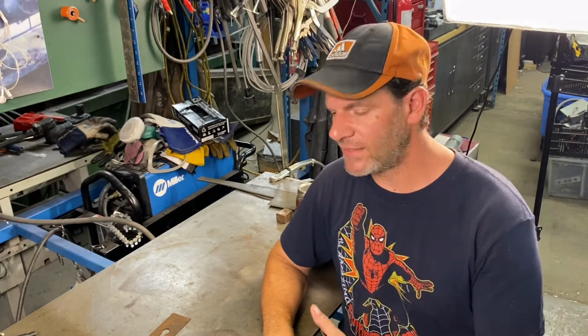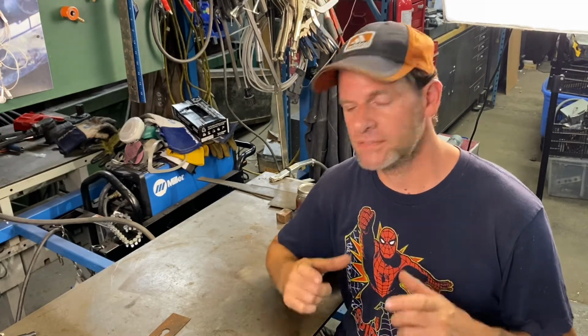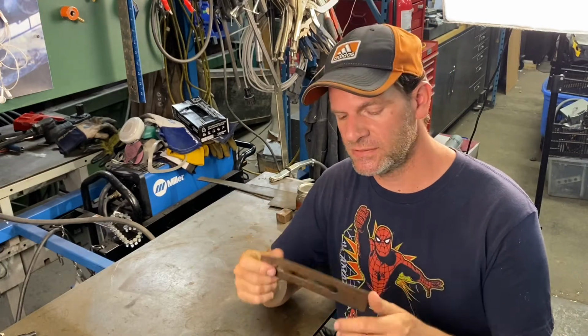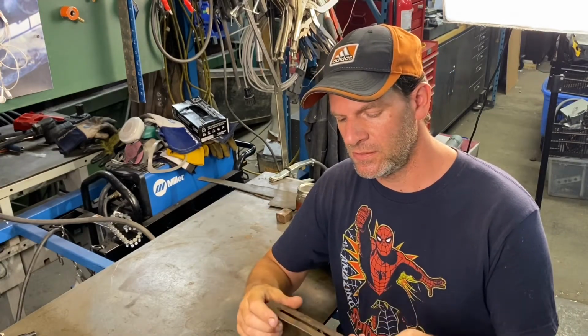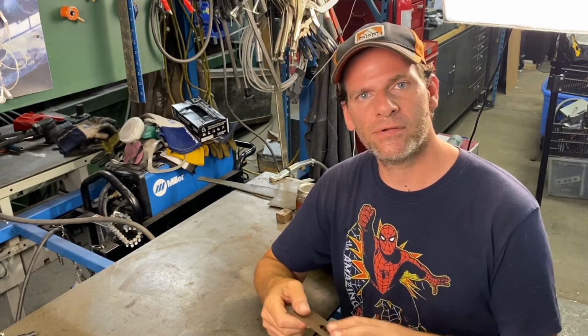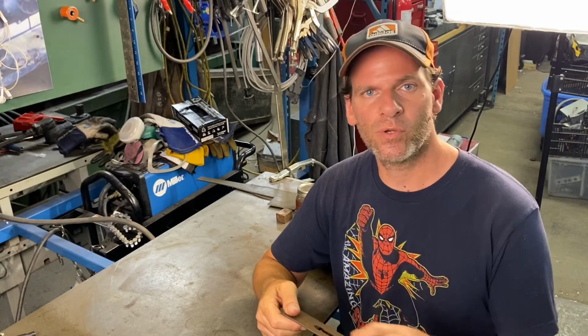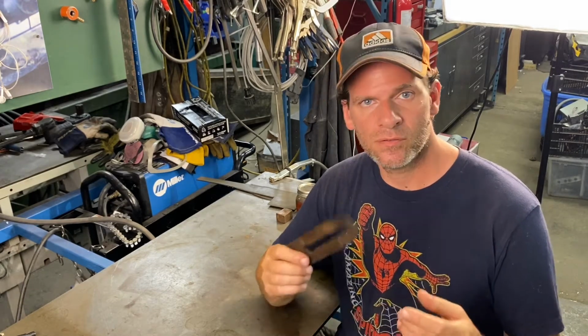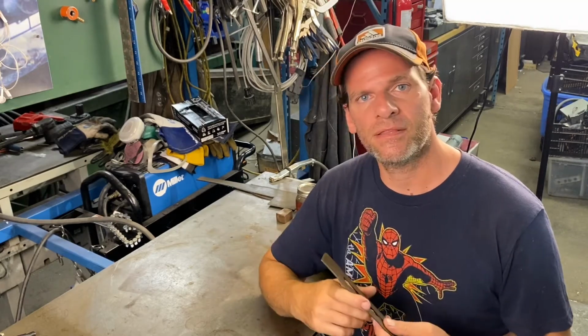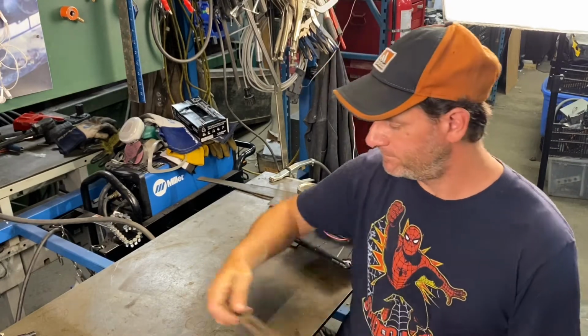I'm gonna take that, turn on the forge, forge it out and make it approximately to this size and thickness. And we're gonna machine it and then grind it down. And we'll do a little pre-etch to look at what the pattern is or where the pattern will be. And then we can machine it and get it ready for fitting this antique plane.